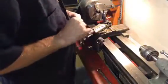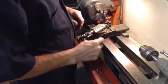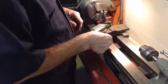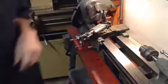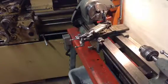Now, right where the little screws hit the head of the bolt, I took a small drill and just drilled a little dimple into it so the screws would catch real good, so it wouldn't wiggle off this way. I mean, that's a lot better than grabbing this every time. Now I can put my wrench back in my toolbox where it goes.